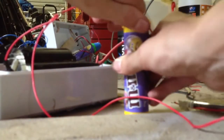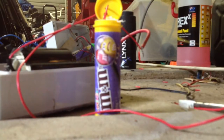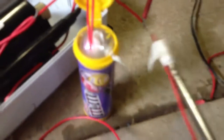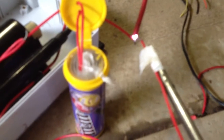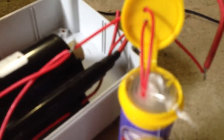Discharge. I'll open it to see what it's like on the inside. I know what's wrong — I think I made the plates too big so they're arcing over. There's smoke — it's burned out, it's broken. So yeah, build the plates a bit smaller so they don't arc over the edges, and that'll probably prevent this from happening.